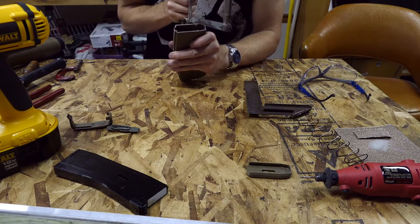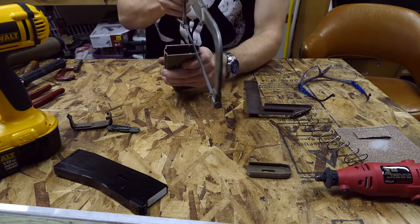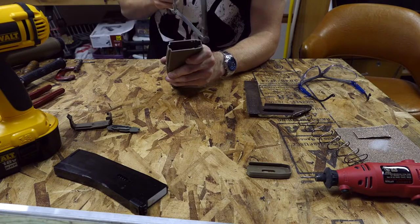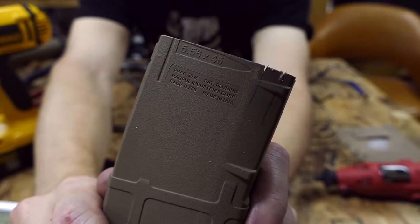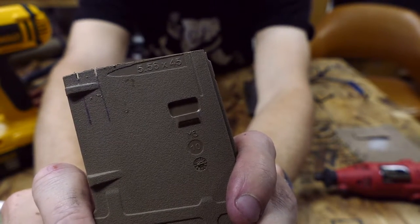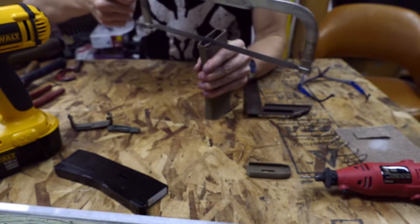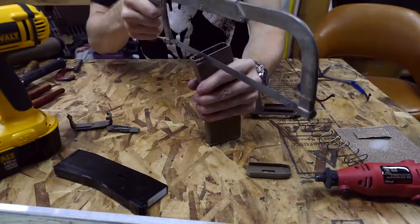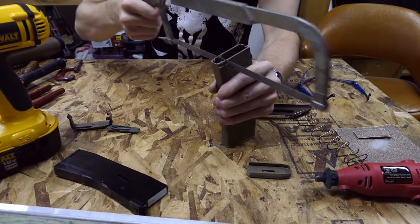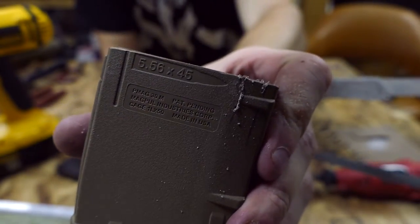Just make some starting cuts with a hacksaw or any other kind of straight edge saw that will cut through the polymer fairly easily. You could use a rotary tool for this, but I highly recommend doing as much of this process by hand as you possibly can - that'll make sure you don't accidentally use your power tools to take off more material than needed. Here you can see the little starting cuts that I made, one on each of the four cuts we're going to have to make. Once you have those in place, place your straight edge saw across the magazine through both cuts, and that'll make sure that when you're cutting down you've got a nice clean straight cut that's the same angle on both sides. Make sure to cut along the line that you marked or else you're going to have something that is lopsided and doesn't look very professional.